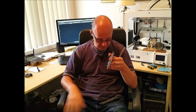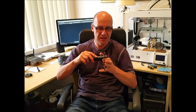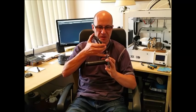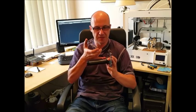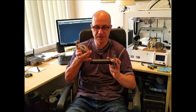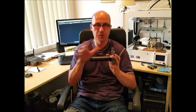So we've got two blades, identical, and we're going to set these blades up on this shaft, one here, and then the spacing between the teeth to the next one is 32mm. So we're going to have to machine a collar for that. I'll probably machine two collars, one smaller so we can just chop and change if we need to. So there'll be one collar between, and then the rest of the collars up to the top, and then a nut is screwed onto the top to hold it all in place.